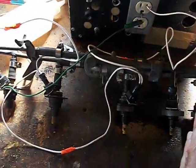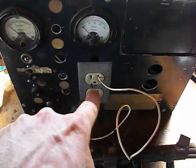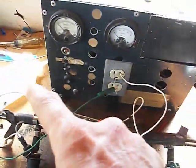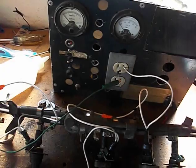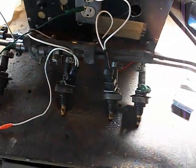I've got the injectors hooked up in series, and I've got a diode hooked up to take the AC and turn it into a half-wave rectifier with no filtering, so you just get a sine wave, flat, sine wave, flat — it cuts off the bottom half. And it's 60 hertz, so you can hear it humming away.